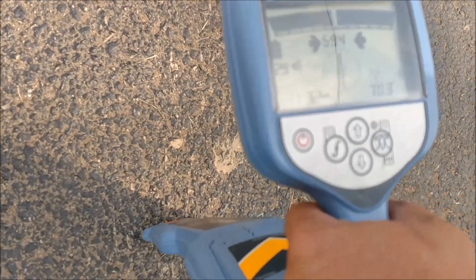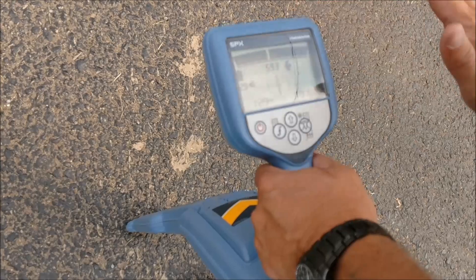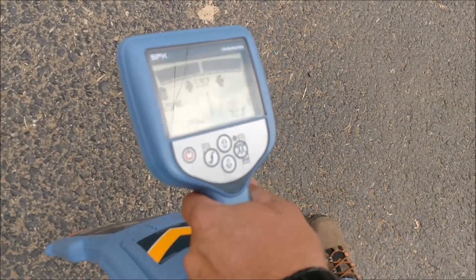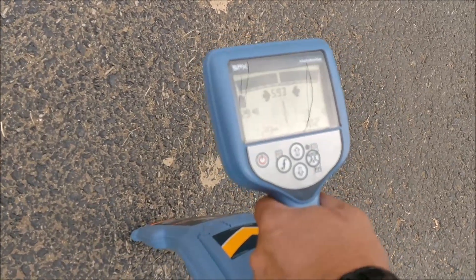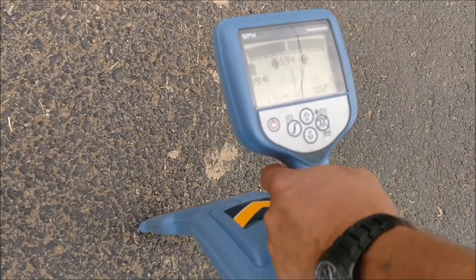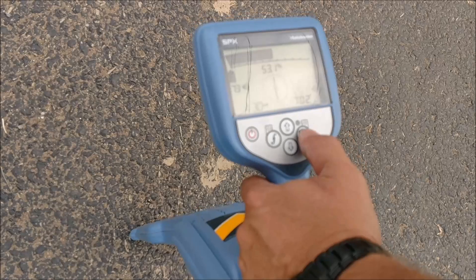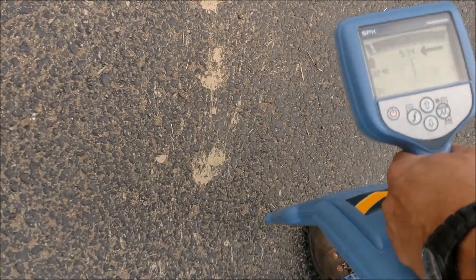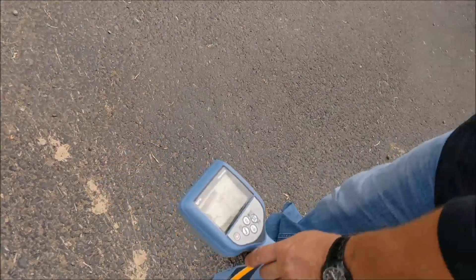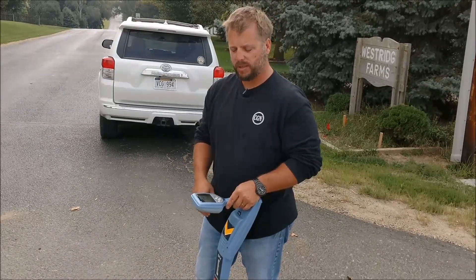This is called guidance mode. It's a downward hill icon with a top on it, and what it does is control the sensitivity level for you, so you virtually have to hit no buttons. All you do is follow where you get the highest number, and it has a little shadow effect up on the top that's emulating the cable or pipe — you get that to the center of the screen and you should be over the line. You get your depth reading, current reading, and compass all automatically. The up-down arrows don't do anything because they're controlled automatically in this mode — I call it cruise control in the locator. In guidance mode, it nulls out or you get no audio when you're over it, which is the direct opposite of peak mode where you get audio when you're over it. Peak mode is faster, much quicker response, but for people just getting used to the machine, guidance mode is probably a little easier to start with.